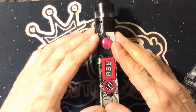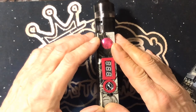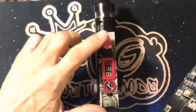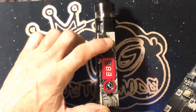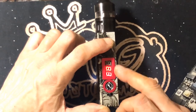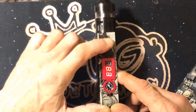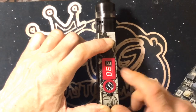As I said at the beginning, it's set on lithium-ion by default. To switch it to LiPo battery, lock your mod — one, two, three, four, she's locked — then hold the button. Hold it for 60 seconds and it will display two on your voltmeter, which means it's set to lithium-ion. Hold it for 65 seconds and it'll show three, which means it's on LiPo. So two is lithium-ion and three is LiPo.